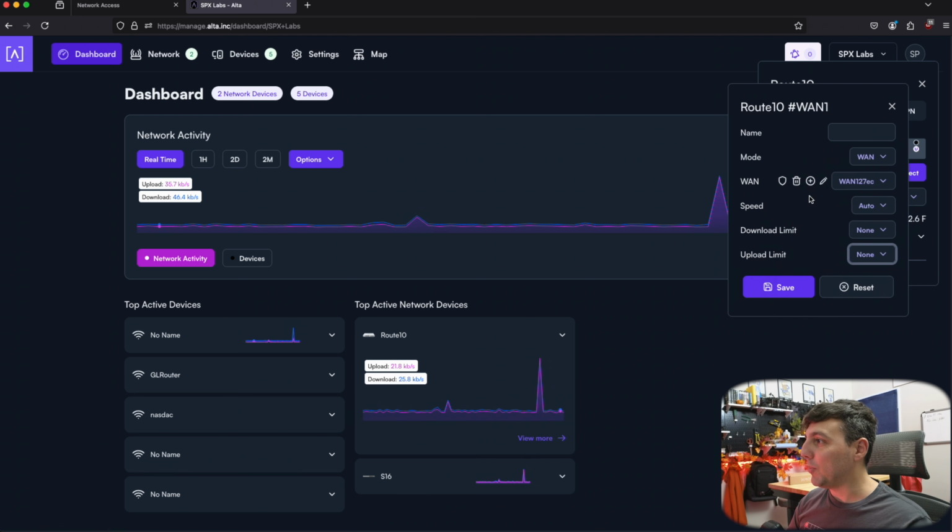We're going to power cycle, so I'll be right back, because it's been over a minute. Okay, so after a power cycle, those changes did seem to take effect. I don't know if that's abnormal or normal. It doesn't seem out of the ordinary. It's kind of a drastic change, but it looks like we still can't get to 192.168.5.1, even though that's the IP address for our Route 10. And our S16 isn't reporting an IP address just yet, so it's probably still going through the boot process.